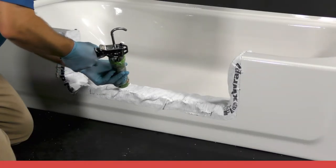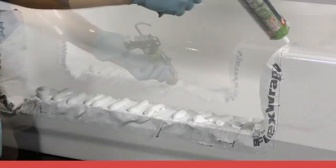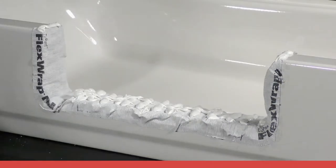If installing the clean-cut convertible or door, apply adhesive to the top of the waterproof membrane. Place a substantial bead of adhesive on the top of the tub where the clean-cut convertible will be seated. Adhesive on the top of the tub is important, as it acts as a sealer and also reinforces the upright legs of the clean-cut convertible.